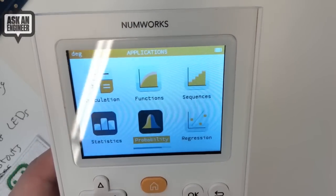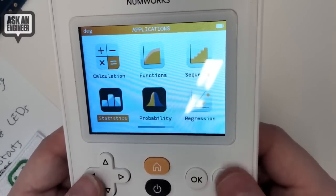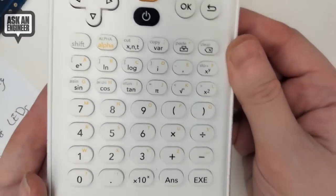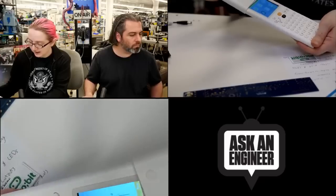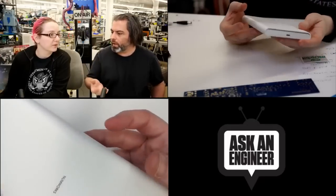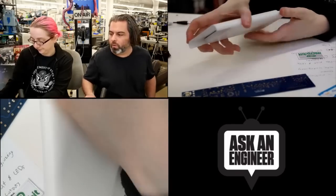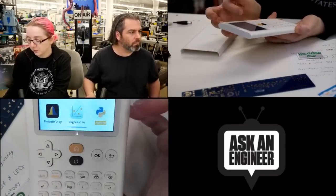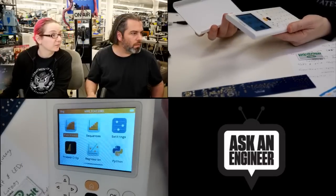They publish the schematics and PCB layout so you can do hacking with it. It's running MicroPython with a really lovely keyboard. You can close the cover and take it with you. It has a rechargeable battery and it's running an STM32 F4, so you're running at about 100 MHz. If you just like to run little Python things, this is fun — pocket Python. There's a USB port, and people are already using it to control robots. It's got a full color screen, and you can firmware update it to enable the Python mode, then add more functions by compiling it yourself for the STM32.